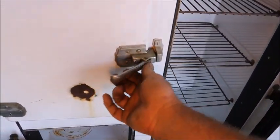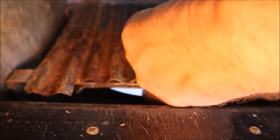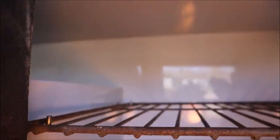This compartment is where you put the ice block. It's open up here so the ice block sits in here, and the air around it gets cooler because it's cold. That heavier air drops down — ice sits on this tray — and the cold air from around it goes under here and comes out this opening, falls down here into the coldest compartment, then as it warms up it rises back up and returns around the ice block again.